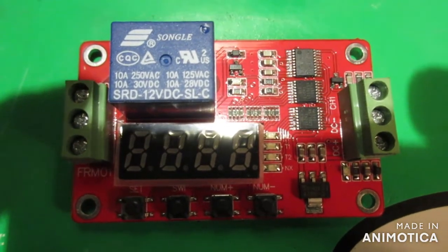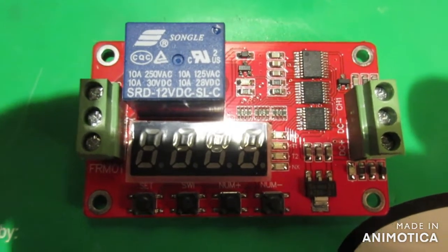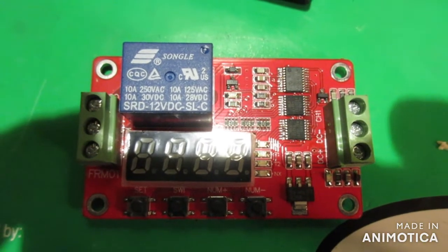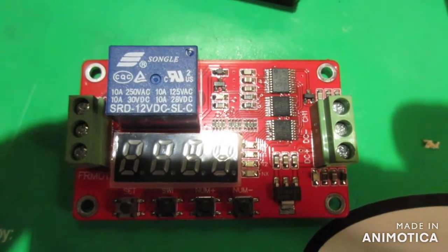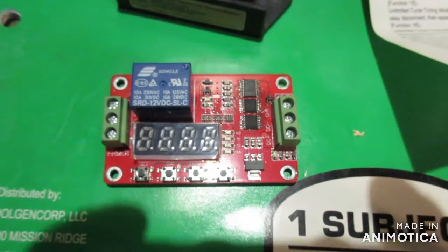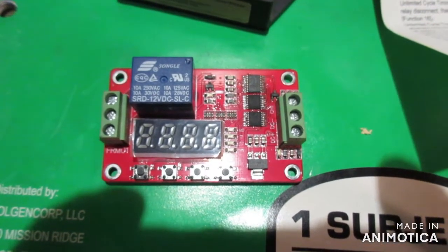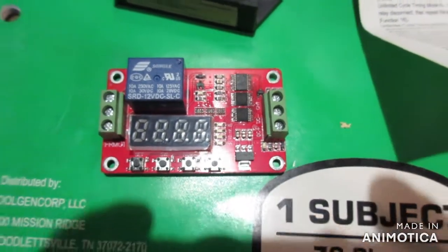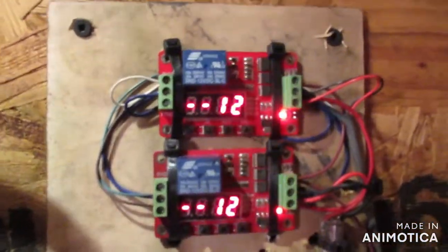There are other functions in here. I think it's function 10 where, on your AGS coming from your inverter, if the trigger is a high signal the board will initiate the relay but it won't start a countdown until it goes low again — so that could be your float mode. You could have this active while that's high, and then once it goes low you could initiate a countdown for like 15 minutes or a half hour for a float mode charge. For mine, I just run a 40-minute cycle.